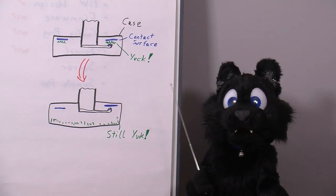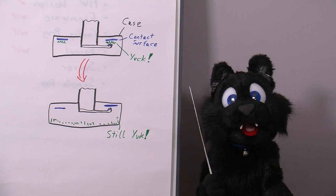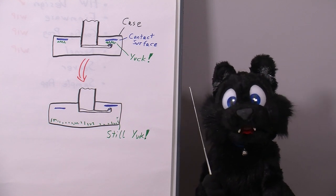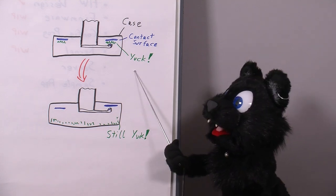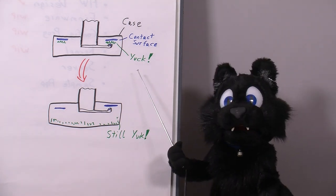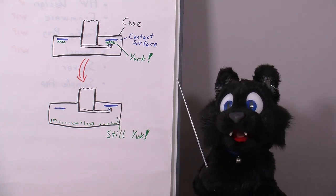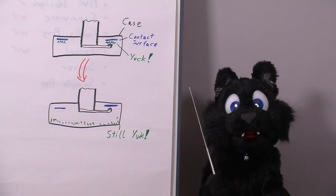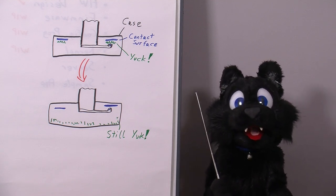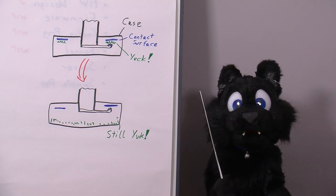On a general note, I am aware that most people would just flush potentiometers and switches with contact cleaner and call it a day. But let me ask you, where does the gunk go that was in there to begin with? Unless you can flush it out somehow, it might cause problems again soon. And that's why I generally prefer to take switches apart and clean them, leaving the dirt out when reassembling them.